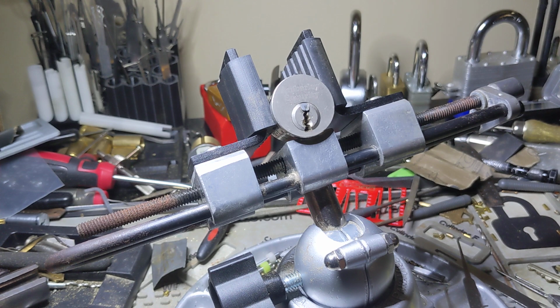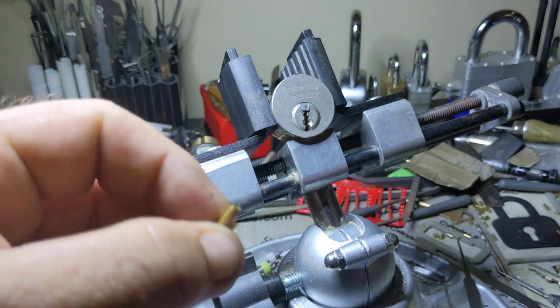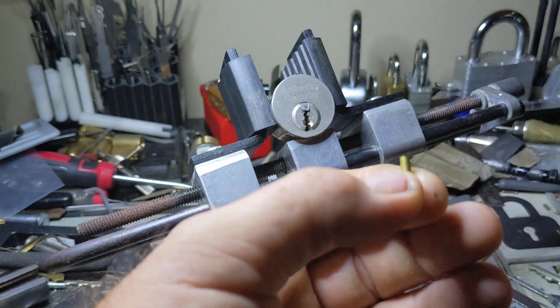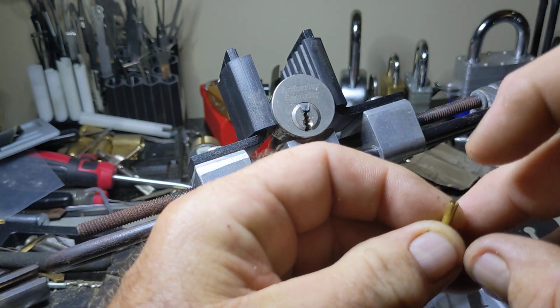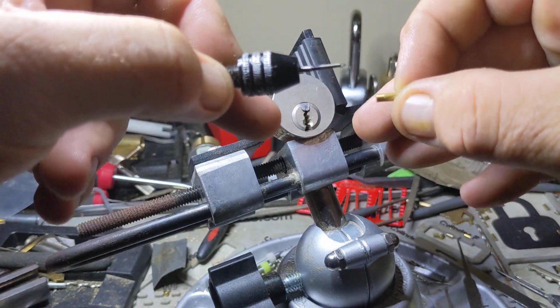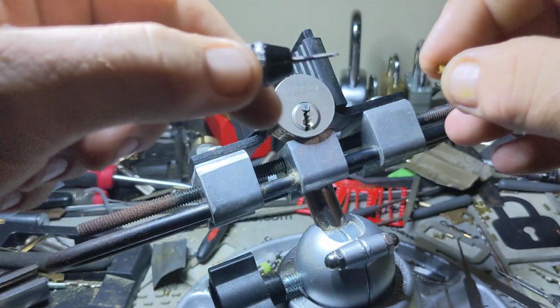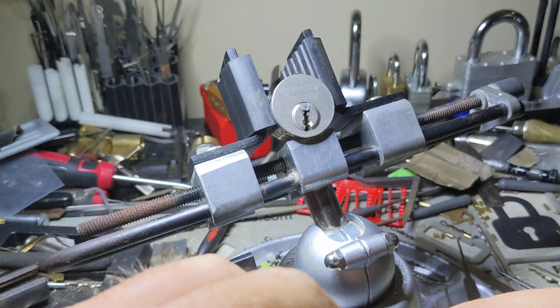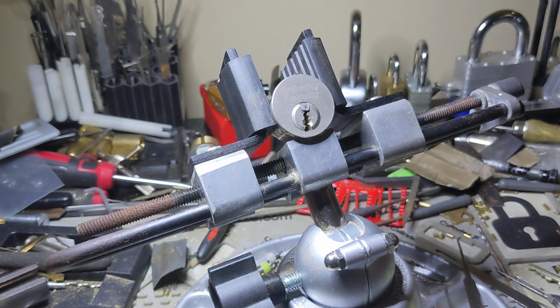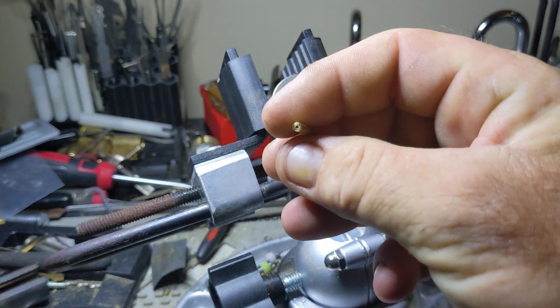And also when you're stepping up from your tubing, I cut off the edges where I cut it with a pair of snips. I'll go in on one side with it in my pin vise, get it lined up, go in so much, stop, take it out, knock out all the shavings, flip around to the other side, and keep going until eventually you meet up right there in the middle. That way you're able to keep the widening of the hole centered. It's not going to be offset. From that there, that's pretty centered.